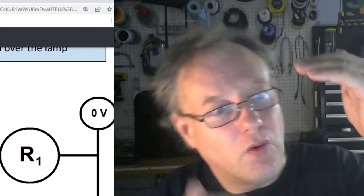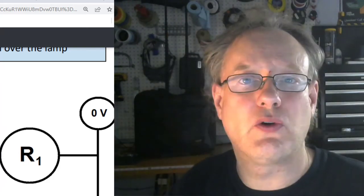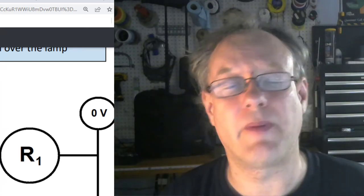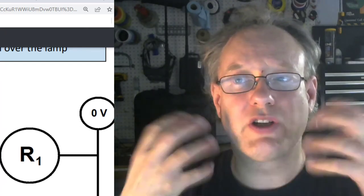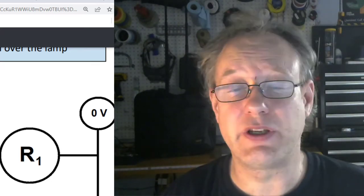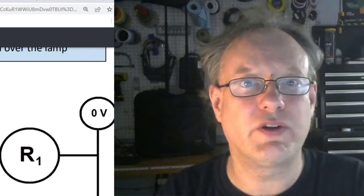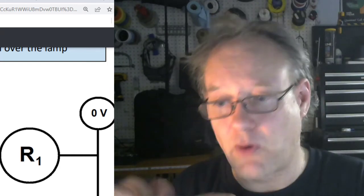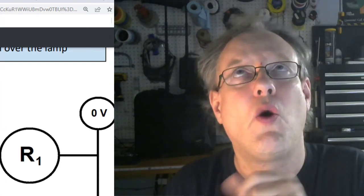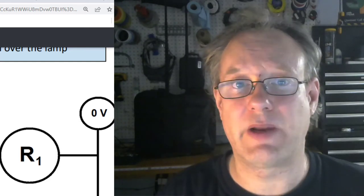And often, down the process, down the critical path, down the path of control, you realize, oh, that's where I need to turn that thing off. That is going to be my termination contact. So don't concern yourself entirely with adding a termination contact when you're designing. You can do it as you go. Just build a holding circuit because you know you need it, and then move forward, and then you'll get to the point where you're like, ah, I've got it. I know what termination signal or information I'm going to use to terminate that.